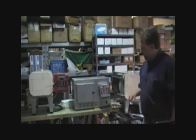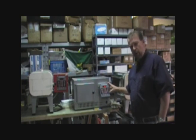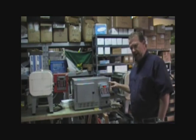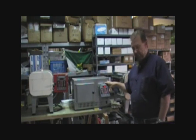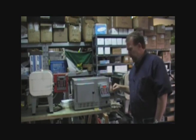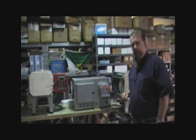The program is now showing complete. It'll go back to standby. There are two alarms in these Ramp Masters. The one we just programmed shows what temperature the alarm goes off at. So this oven will heat up as fast as it can to 1400 degrees, hold that for five minutes, then heat up further to 1950 degrees. The first alarm will go off telling you it hit the austenizing temperature. Then the soak time of 25 minutes begins, and when that soak is done, a second alarm goes off — that's your cue to take it out and quench it, whether oil, air, or plate quench.